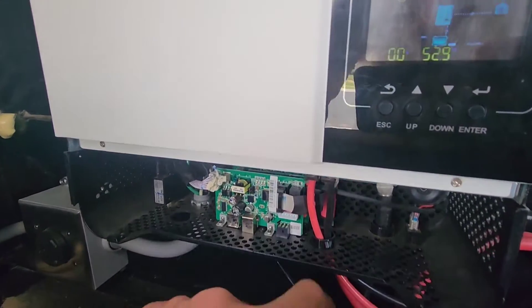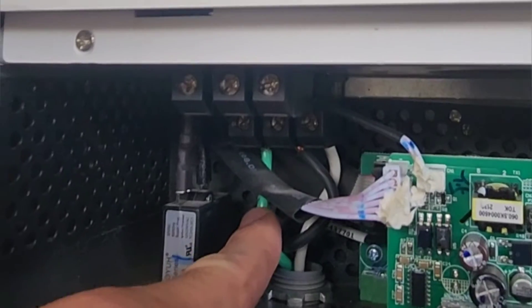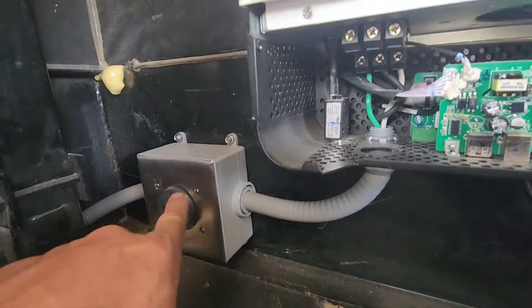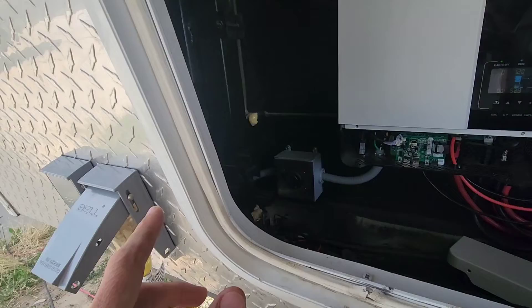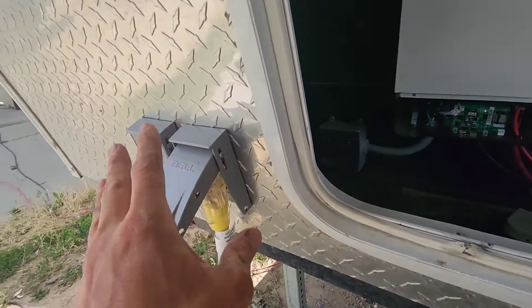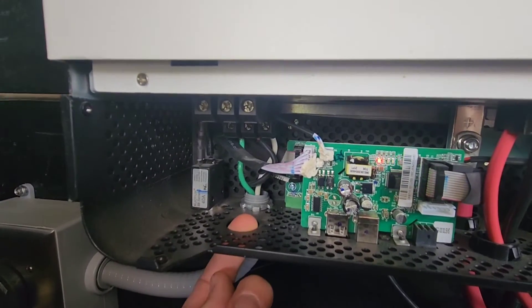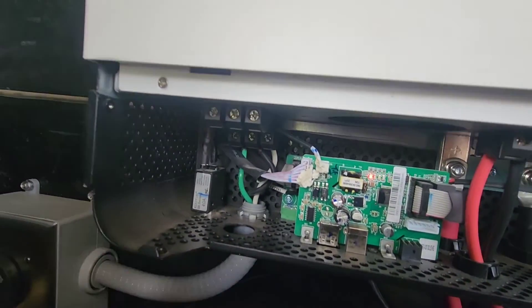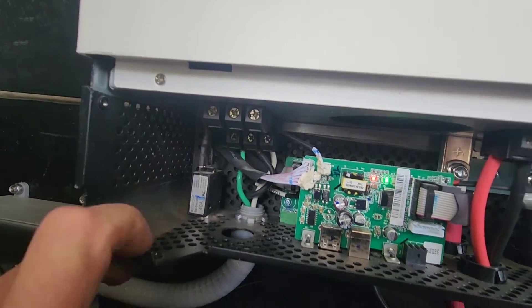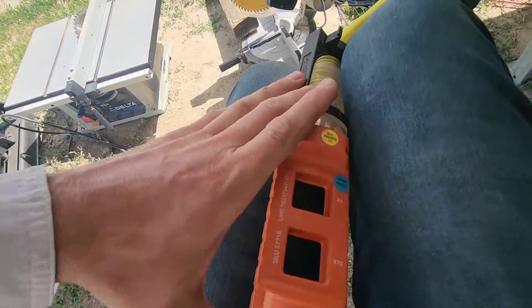Here's the setup I have. The solar panels come in here, and my battery connection. This is the AC output of the unit, which I have going to a 30 amp plug that comes around here and also supplies these additional 30 amp plugs. You obviously can't provide 30 amps from all plugs simultaneously, but it's safe because this will shut off if it tries to pull too many amps — any single plug can provide about 30 amps. Over here I could provide AC input if I didn't have solar panels charging my battery — I could wire it right there to those bolts.